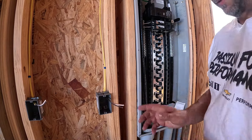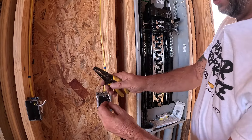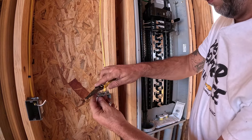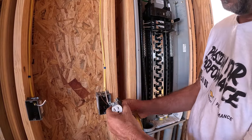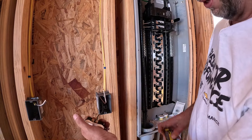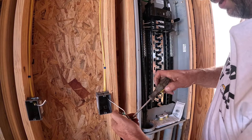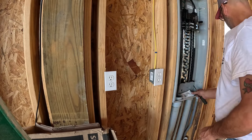Now we are off to receptacles. These are super easy to install - just make sure you've got six inches of conductor, strip these, and the strippers have little holes in them for making loops. Nice little happy loops. Remember: black goes to the gold side, the little skinny one in the skinny slot, and you always want to make sure you hook them clockwise. It's imperative you get that clockwise action going because that sucks the tail of the conductor under the screw. If you go the other way it'll push the conductor out instead. Super easy. Straight up and down. It's a thing of beauty. We've got our power all in - two receptacles.